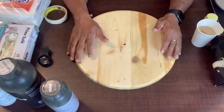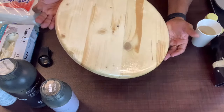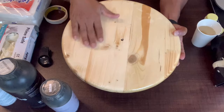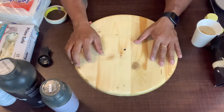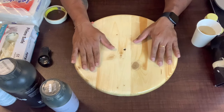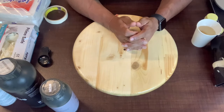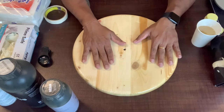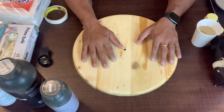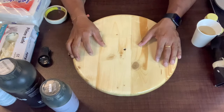Whenever you work on any base, make sure it is completely prepared. This is the pine wood I mentioned. I have prepared the base by applying a thin coat of resin on it, so the wood won't soak extra resin during the final coat. You can do this for MDF, HDF, or any natural wood. However, you don't need this preparation for glass, acrylic, WPC, PVC board, or any non-porous surface — unless you paint the base with acrylic color.